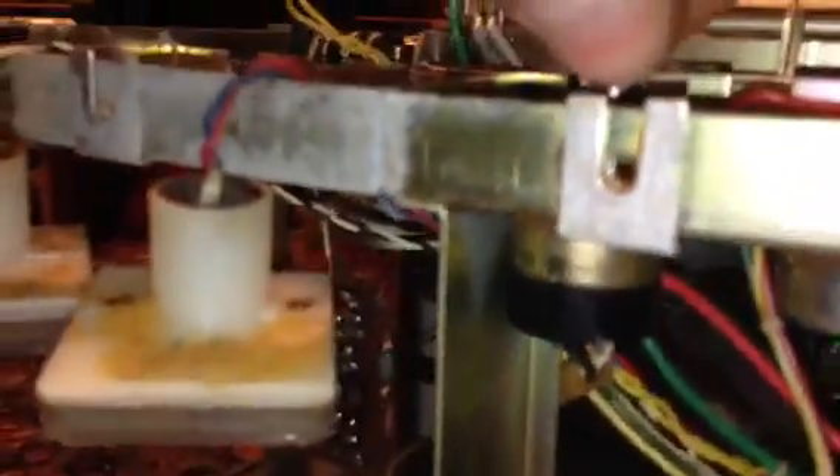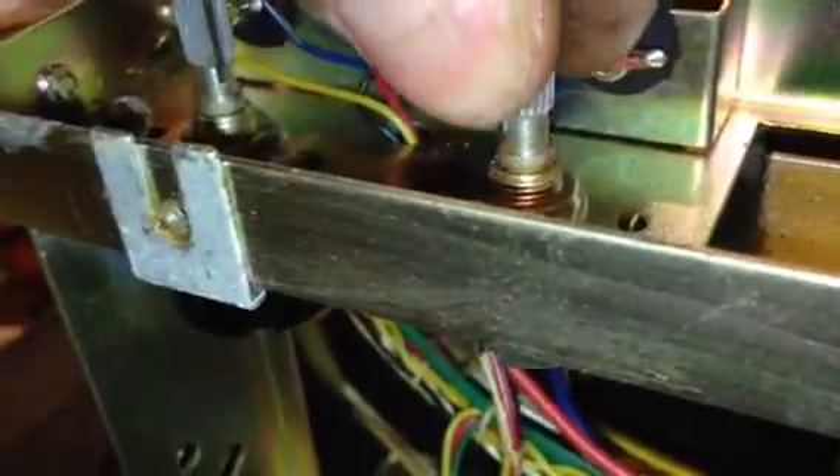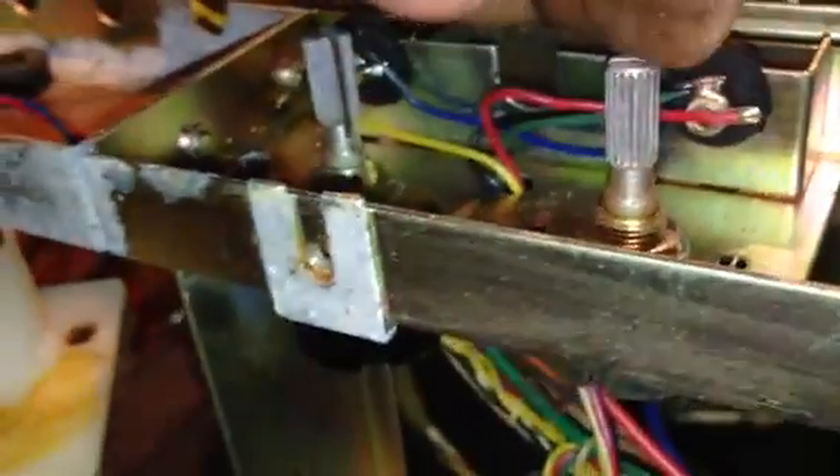This is the screwy pot here - I haven't even looked at this yet. That one's got a piggyback on it for the power off and on, which is strange. There's the power off and on, they're nice and solid. There are places I can get in there and clean them. I think I'm going to have to tighten that up. Yeah, the wiper is not going to touch right, but I need to clean it and try to bend it. There's a lot of neat little stuff in here. I love the way they use real screws to screw everything in on the switches.